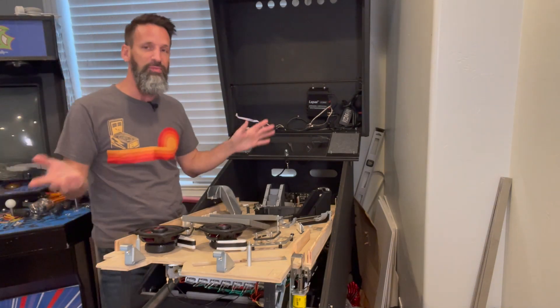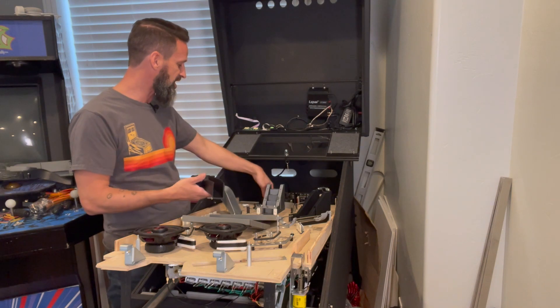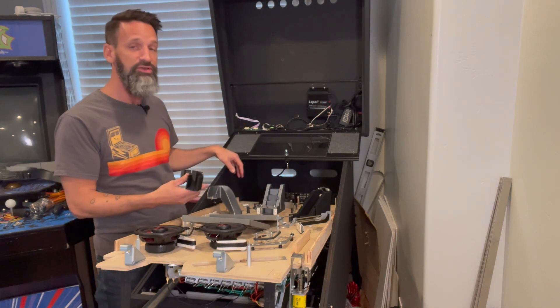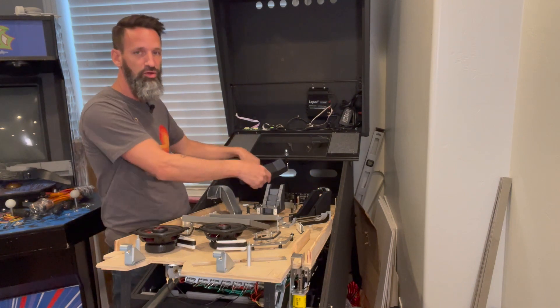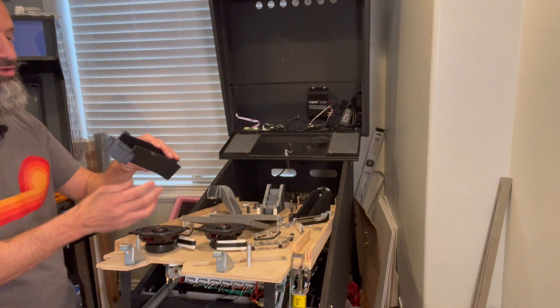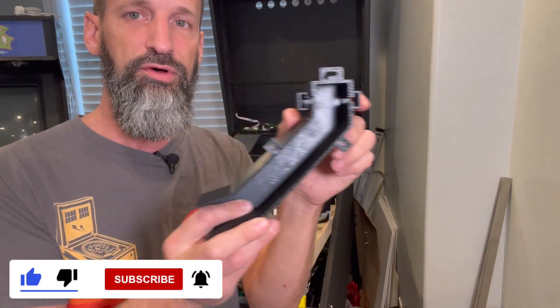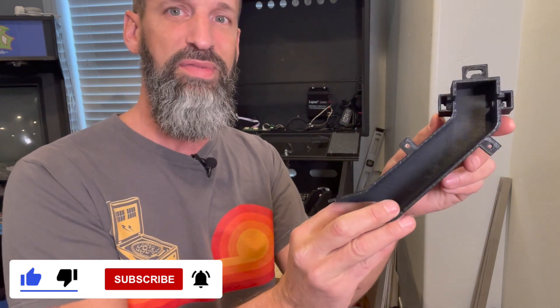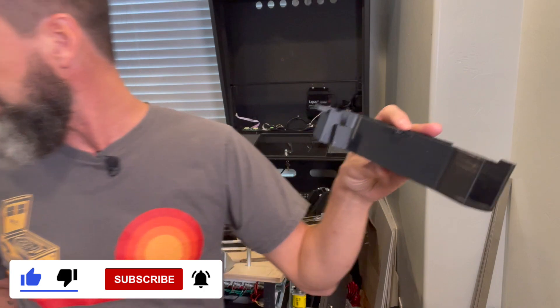Here's another cleanup I needed to do — the subway. The way things are setting up, I need to make sure I actually had a switch detecting when the ball entered the subway versus just having one sitting at the back, because I need to know how the ball came to the back. So I went ahead and reprinted the subway, and now it has these two little holders on the side.